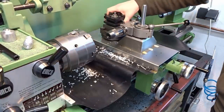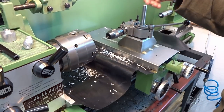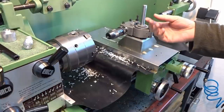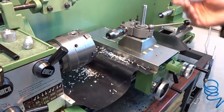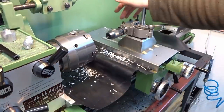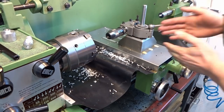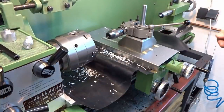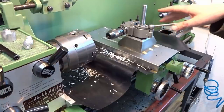I can do threading without a compound without any issue - straight in-feed is an absolutely viable feed method for threading. If you go back to my drink bottle threaded adapter videos, I did a 70 by 3mm trapezoidal thread in stainless steel and had no issues straight in-feeding. I'm not a big fan of running 30-degree in-feed for small threads on manual machines - don't see a reason for that. It's a waste of time, and also it's one DRO axis you don't need. Rant over - back to drilling.